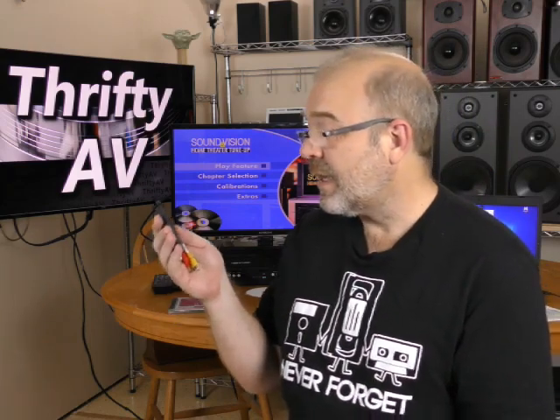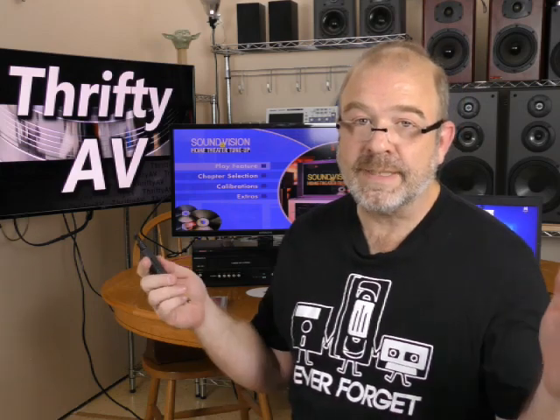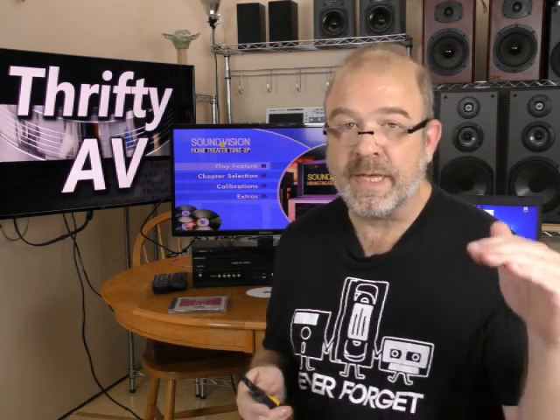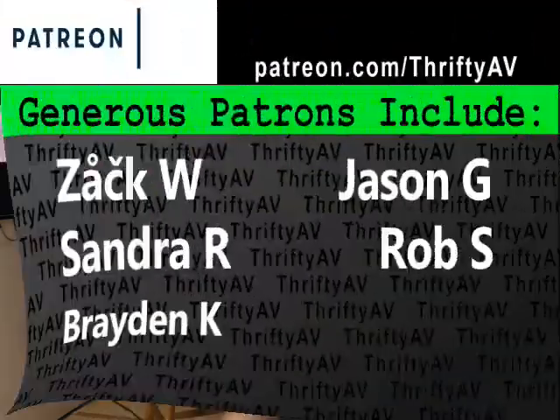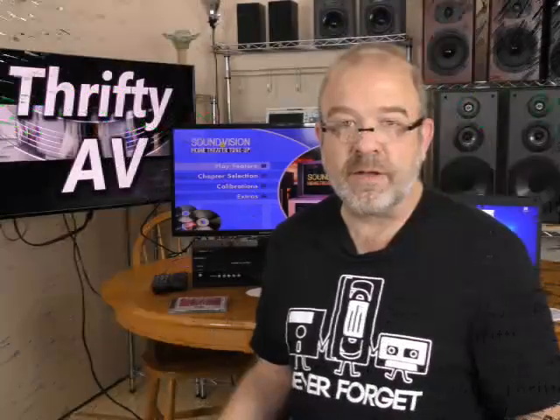This series of tests has caused me to reevaluate my $11 EasyCap device. The video is okay, especially the composite video — S-video not so much. But the audio is pretty terrible, mixing left and right stereo into mono and putting a DC offset on it. Thanks to Vince S. who listed this Sound and Vision DVD for trade on SwappaDVD — I could not have done this video without it. Thank you to my patrons for supporting this channel. Stay thrifty, everyone!